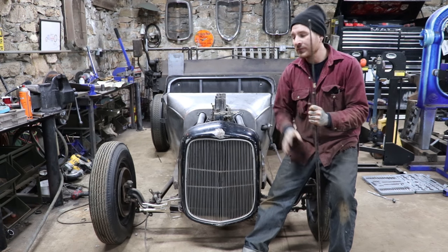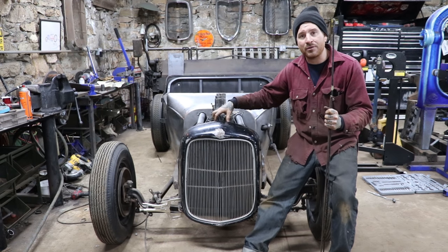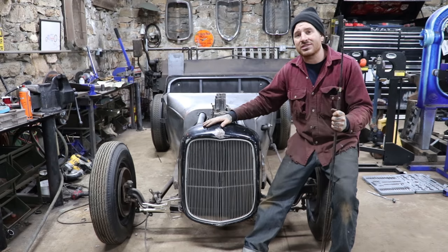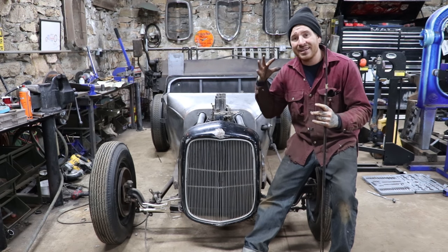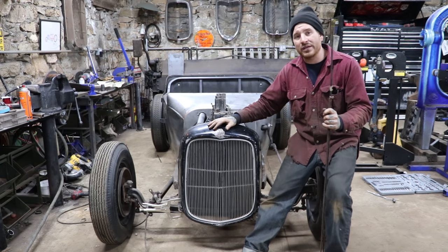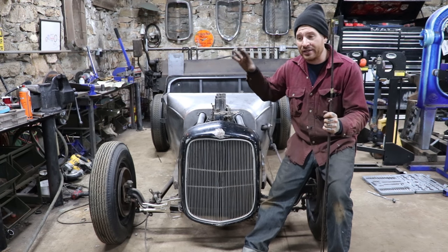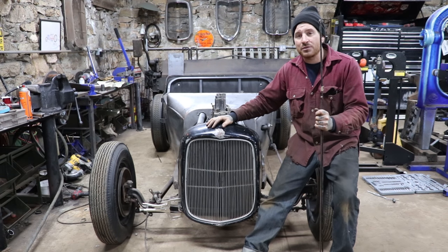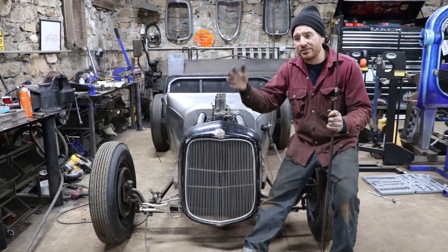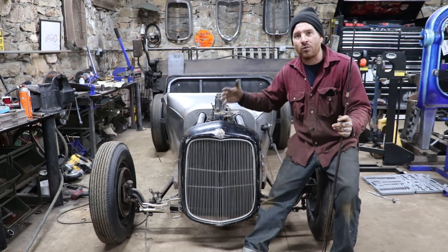While he's working on that, I'm gonna work on getting the radiator support rods for the top of the radiator. I'm gonna make a set of those. Now, everything on this car is really tight and compact, and it is difficult to get everything to fit in one place, especially in the engine bay area. So I'm gonna need to build some support rods that have some crazy bends in them so that they fit around everything, and also will go into the firewall and support everything.